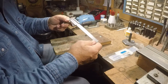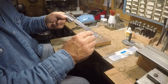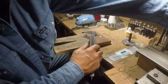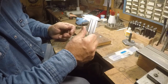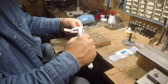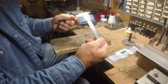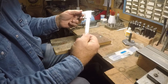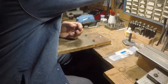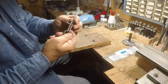The caliper is real important. It's marked off in 1/1000th of an inch and also 1/20th of a millimeter. And it can be used to measure the gauges of silver, or sterling, steel, whatever, and also can be used to mark different measurements on the silver. I don't know what I'd do without my caliper. Very handy, and this is a quality one. You want to get a good one. And I don't really like the digital ones. I have one, but I don't use it much.